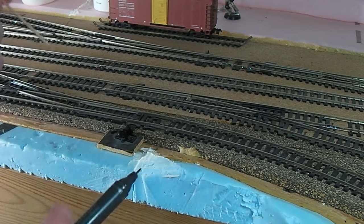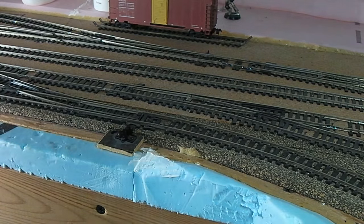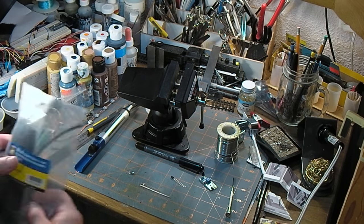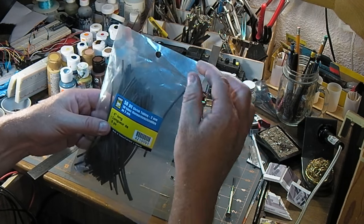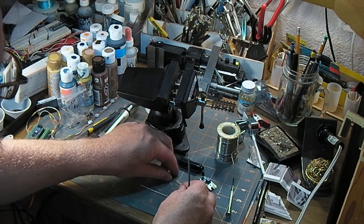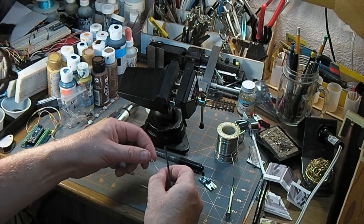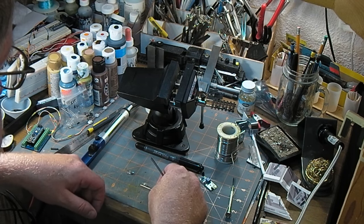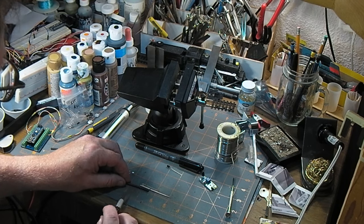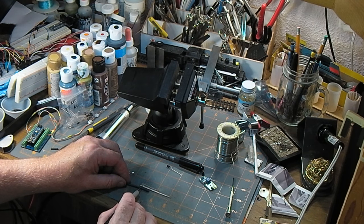There's my thickness right there, which means that's going to be about the length I need my LED and my infrared sensor. I'm back — there's my calibrated toothpick. Get some 2mm heat shrink. I should use spaghetti tube but I don't have it. I want to put a bit of heat shrink on there just so that the leads don't splash together when they're sticking way up like that. I'll only put it on the two leads that are closest together. That's the top of the rail, that's the bottom of the deck. Add about like that and measure.